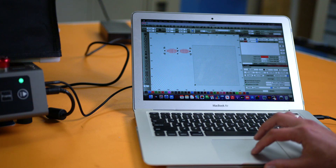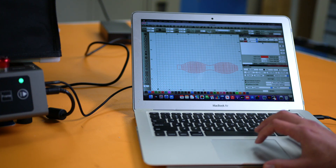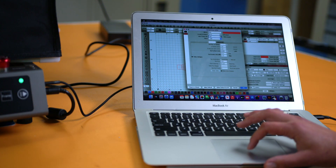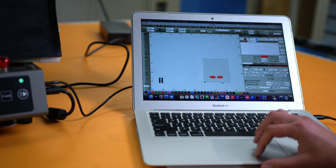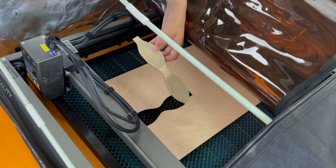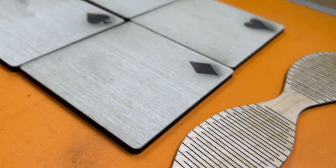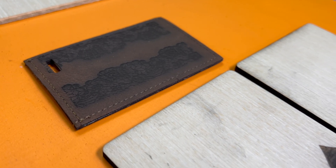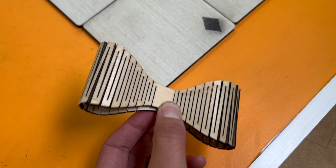The next project is a cut on eighth inch thick plywood to see how this handles detailed cuts via a living hinge bow design, available on our website and linked in the description. It needs to cut through the plywood cleanly but also not burn everything up so much that it all falls apart. As it's cutting it looks really clean, and lifting it out it cut through like butter. We often work on CO2 lasers and we've tried a lot of diode lasers at this point — with the 40 watt head and the tent over the top, this is probably the first diode laser cutter I've tried that truly replaces and potentially even outperforms a Glowforge-style CO2 laser for a lot less money.